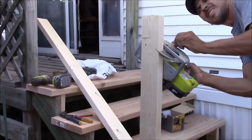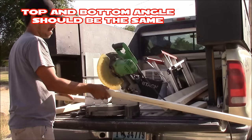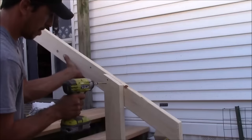Now we're going to remove the 8-foot 2x4 so we can make our necessary cuts. We'll start by cutting the vertical upright on the bottom — make sure to save that little cut piece, we're going to use it for some vertical uprights later. Now cut the top piece of railing on the marks we made, and make sure to write down the angle your saw is set to. Then grab another 8-foot board, cut the end at that same angle, and use that for the bottom railing.